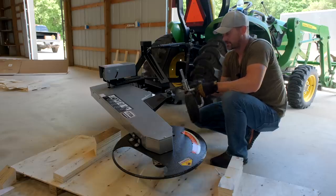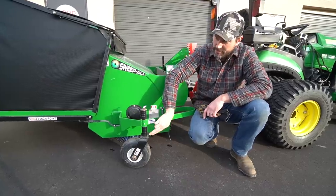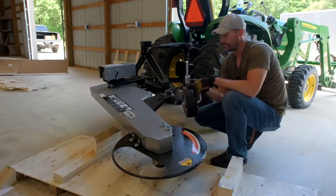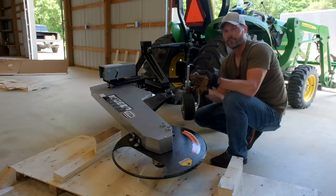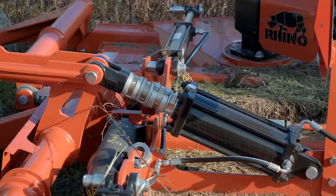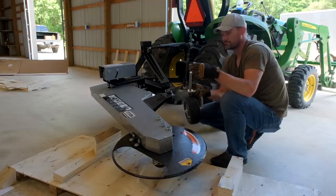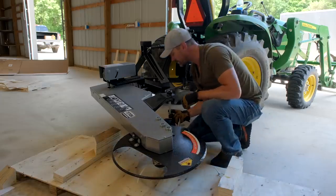So these are those washers, and another place that you might have seen these on our channel would be on the sweep all sweeper, it's got similar gauge wheels for cut height. And then sort of a variation on these, a little bit different, is gonna be on the Rhino Batwing or the Flex Wing mower. You put these on the PTO or on the hydraulic rod, and you can adjust your cut height with that as well. So a fairly common application in the agricultural world.